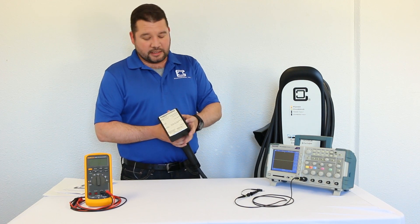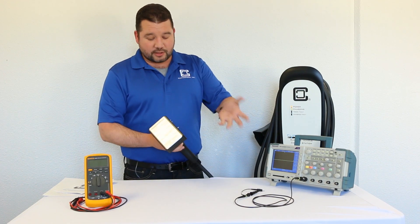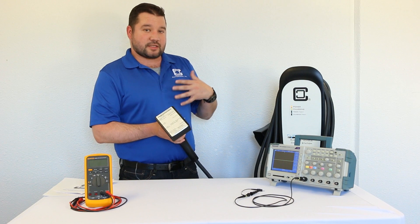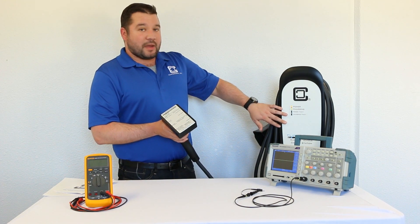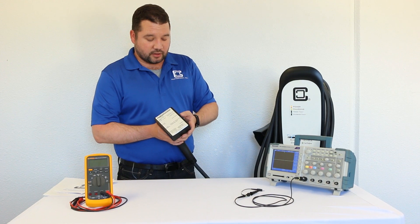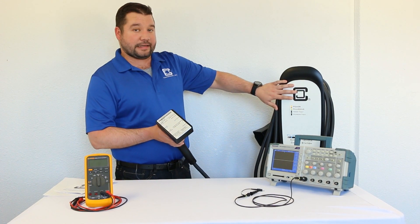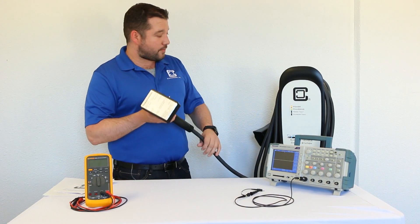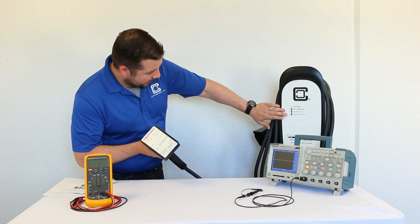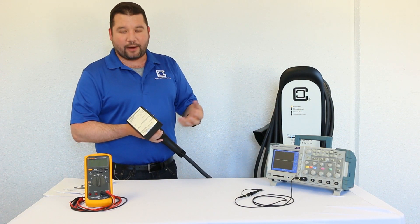Next, we're going to simulate a CCID fault — this is a ground fault that simulates current leaking to ground. One of the EVSE's main functionalities is to provide electrical safety for the user, and it uses the CCID safety circuit to do that. When we trip this, if the EVSE is functioning properly, it should stop charging: the green light will turn off, you'll hear the click of the contactor opening and removing power from the circuit, and a fault light will come on. We've got our fault light, the click, and the green charging light turned off. The red light on the CP50 also turned off, so there's no power available on the tester.